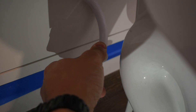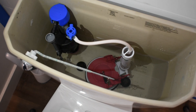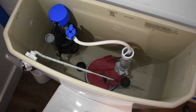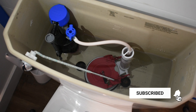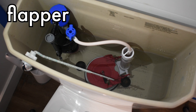Go back down to your water supply and open the valve all the way. Then go back to the tank to make sure you're watching the water fill up appropriately at a steady pace — that there are no leaks, it's not dropping back into the toilet, and everything looks good. Once the tank is completely filled back up at the appropriate water level, sit and wait. Try to listen for any water leaking or anything that could indicate the water is still trickling through the flapper into your toilet.